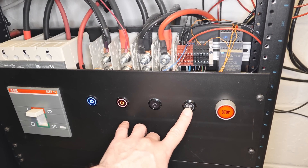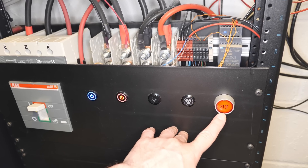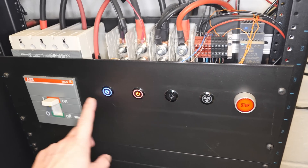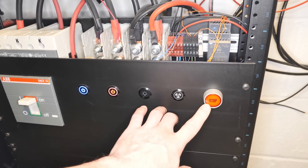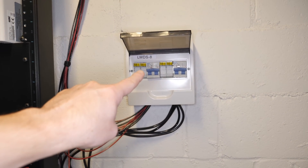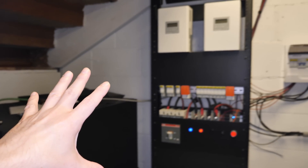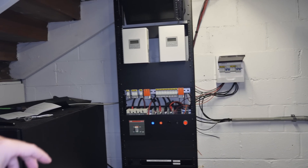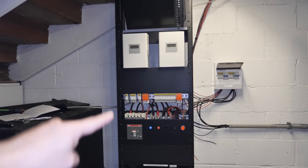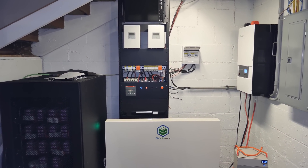All of this here had my solar and stuff. Right below that is my shunt trip breaker, and then I've got an on/off switch which turns on and off the UPS — that's what I used for my inverter. The next switch is a light switch for LED lights going all the way around. There's a fan switch in case I needed to add fans later. And right next to that is my emergency stop switch which is connected to the Batrium, and the Batrium is connected to the shunt trip breaker — if I push that it'll shut down everything.